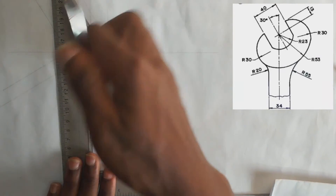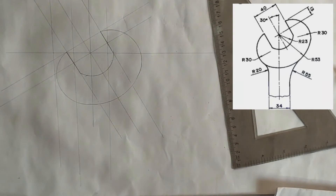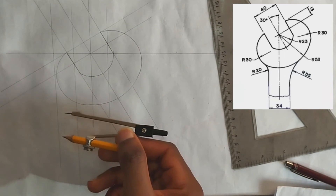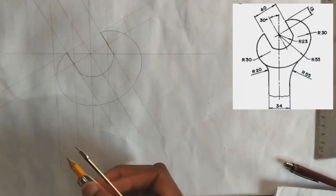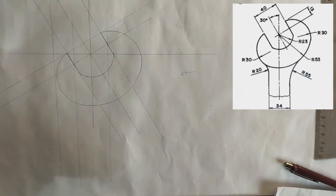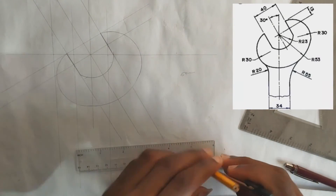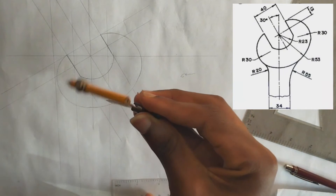There's 20 here, so we want to draw this inner arc. This place is 30 millimeters — that is the radius of 30 millimeters — and this place is going to have a radius of 20. We apply addition: 30 plus 20 equals 50 millimeters. So we are going to be picking 50 millimeters from the point where we drew the radius of 30 curve.